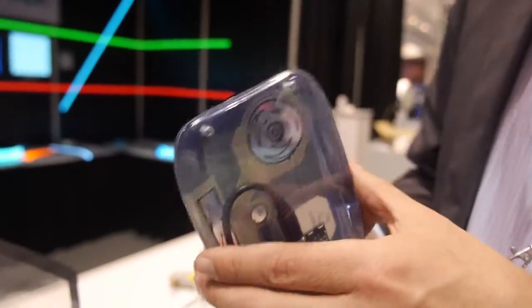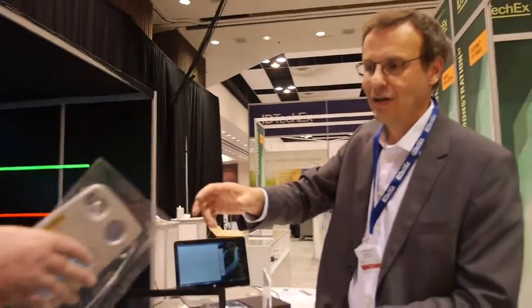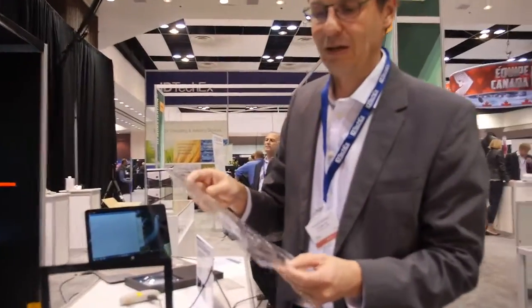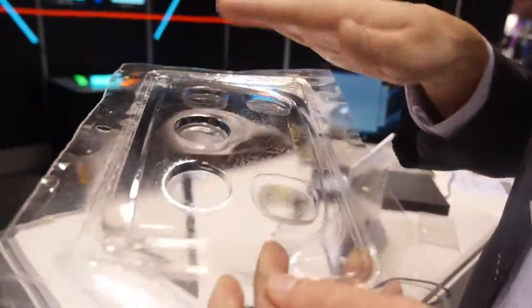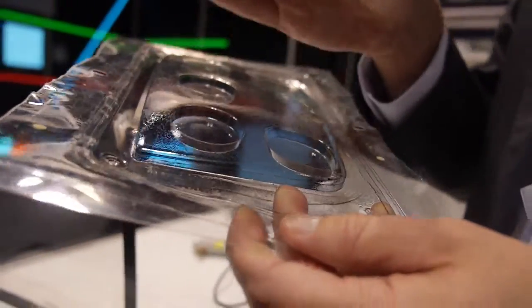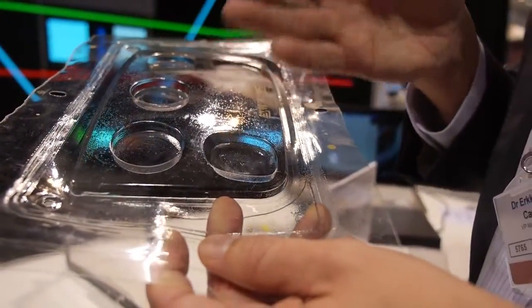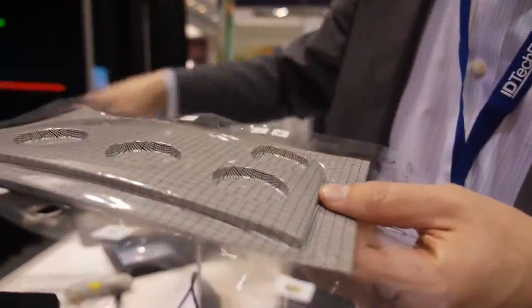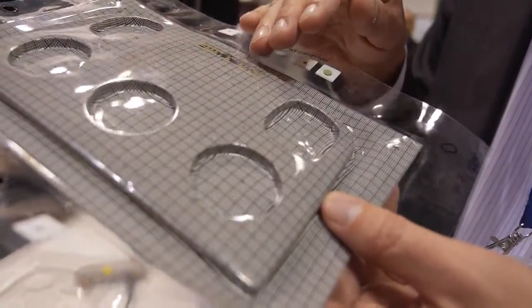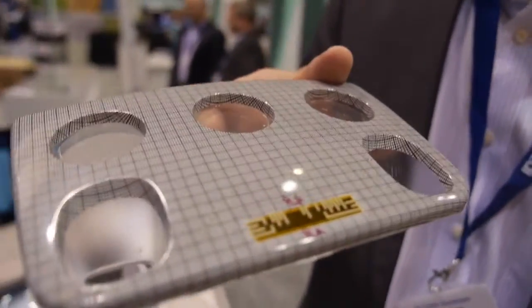How do you make it? We start from foils. Initially we have a flexible film on top of which we coat our carbon nanotube material in a continuous roll deposition mode. After that, we pattern it into sensors to make a flat sensor, after which it is thermoformed into the desired shape. Then we can print some decorative coatings on it, like in this example. After that, we back mold it with a plastic, which is injection molded — in this case, polycarbonate injection mold.